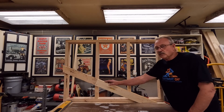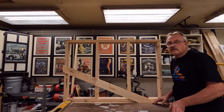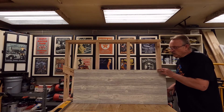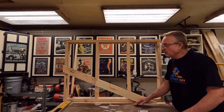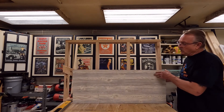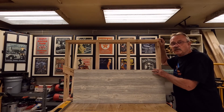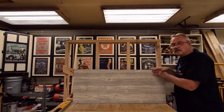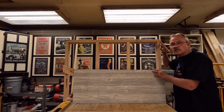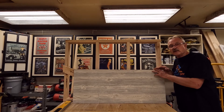The first angle we're going to work with is this one right here. I've set up this mock wall and I have this piece of scrap paneling. What we're going to do is cut this angle on the bottom of it so that it sits on here nice and perfect. Unfortunately it won't reach the top of the wall, but that's okay — typically the top of the wall would be your goal. For this demonstration, this is what we have, and you would still use the same principles for the measurements.